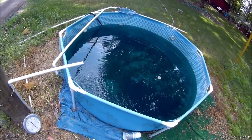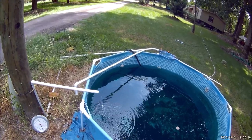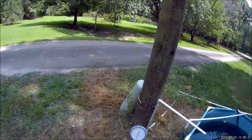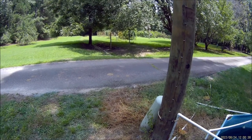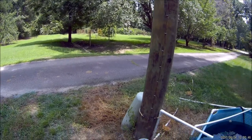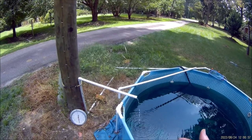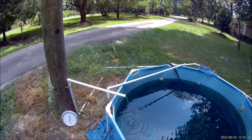If you do a field test on your ram pump with a short delivery line, say 50 feet, you might get a 30-gallon-per-hour reading. But once you go 400 to 450 feet of delivery line — especially if that line has been used for a year or two — there's going to be a lot of drag on that line, a lot of junk inside putting drag on the water. It won't flow as smoothly. So with one pump you might get 12 to 15 gallons per hour; put two together coming up the same delivery line and it's probably around 25 to 30 gallons per hour.